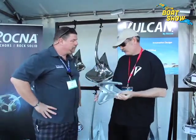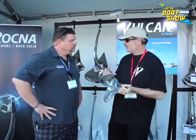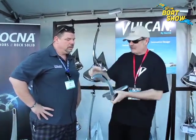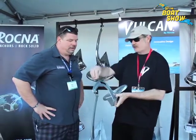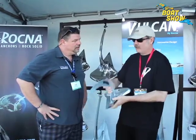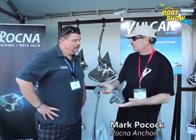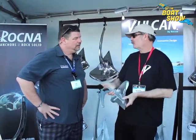In order to achieve the rollover function that the Rockna achieves with the roll bar, we had to take a different approach with this design. We added ballast here which lowers the center of gravity of the blade. We took weight out of the shank by making an I-beam construction that lightens it. The geometry of the curvature of the shank combined with the curvature of the back of the heel — if it hits on its back it will roll over right away onto the side. Once it's in that position it's just like a Rockna: a third of the weight on the tip, scoop shape, very fast penetration, excellent holding power.